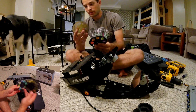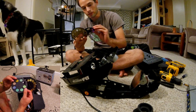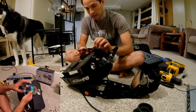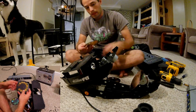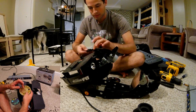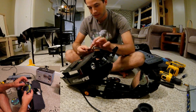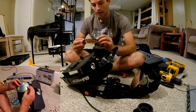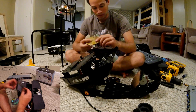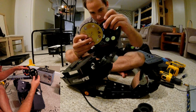There's our color wheel and our gobo wheel. The colors are literally just pieces of glass that they glue on, so you could always pull these off and swap them — if you want different colors or even put a few different colors in to do multicolor effects. Here's the gobo wheel, and all it is is a stamped piece of metal. They made the gobo from a really thin stamped material so it's cheap, then put it on a thick piece of metal with holes in it so it's stiffened and supported. You could take something and glue it onto this piece to make your own custom gobo. So this wheel goes around and gives you different gobos while the other gives you different colors.